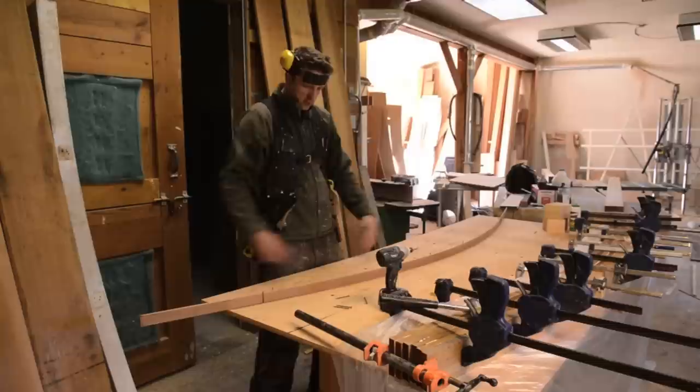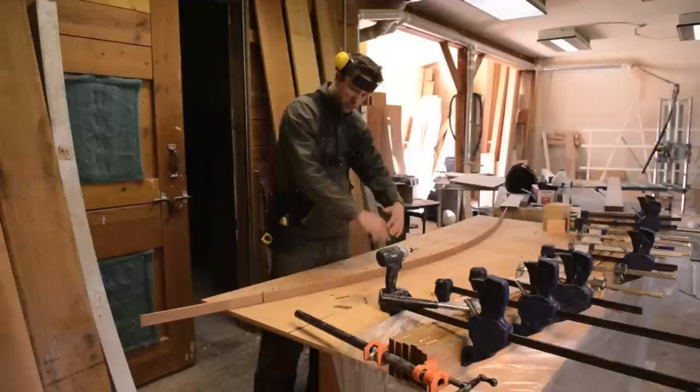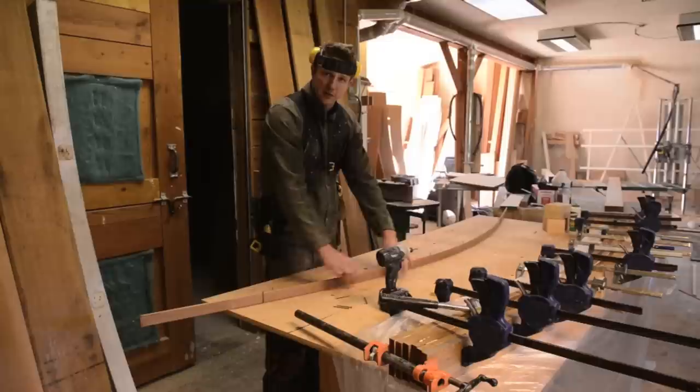And so what I've done is I ripped my 1/4 inch strip, like I had mentioned before, I've got screws set on my marks, and then I just bend my quarter inch strip so I got a nice even curve, and then I trace this out. Then I screw my blocks onto here. Two plies, I've got an inch, the bottom rail is only 1.5 inches thick, so I'm just going to do 2 plies of 3/4. Glue those up, and then this side of the railing will be done.